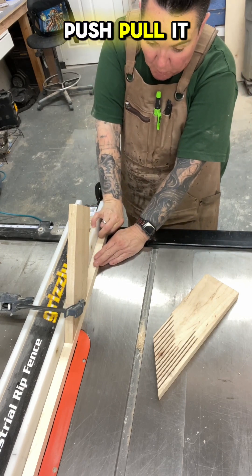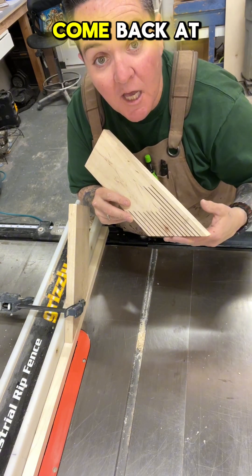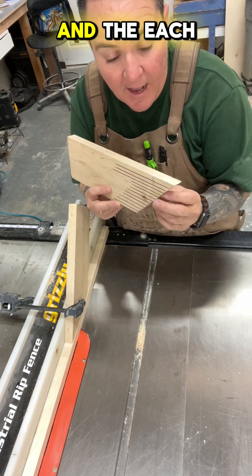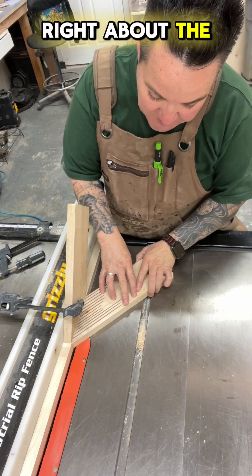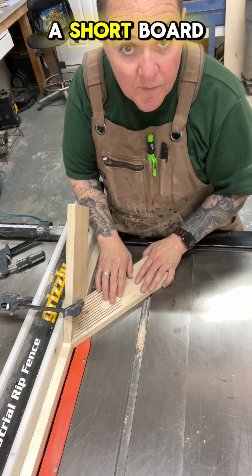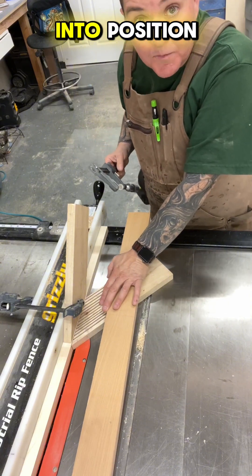You can push material through this way, but you can't pull it back through — it's pretty tight. These featherboards allow the material to go through your saw in one direction but don't allow it to come back at you. Each one of these fingers or feathers flexes, so if the material tried to come back, each finger would stop it. Clamp the second one down to the table right about the same area as the one on top so they work together to keep material both down on the table and against the fence. If you're using a short board, place a longer piece of wood over it and clamp that down as well.